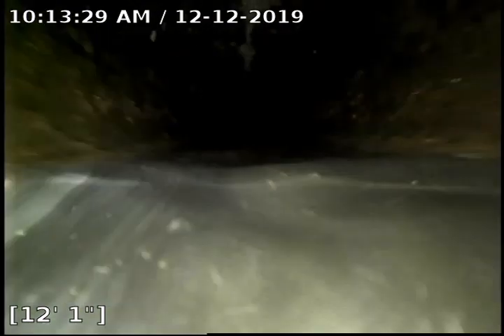We're going down to the clean out on 3412. Right now we do have some water running. We're going to zero the footage meter out so we get accurate footage. Right now we're in 3 inch ABS pipe proceeding out towards the street. There's a manhole in the driveway which looks to serve 0-3 units that tie into that manhole and then lead out to the city on a 6 inch pipe.